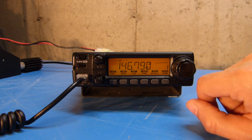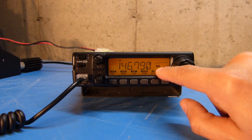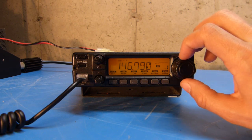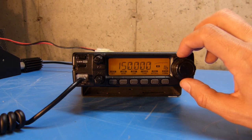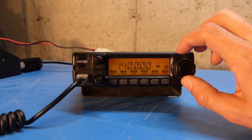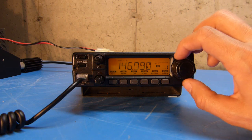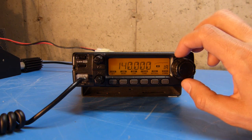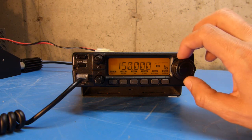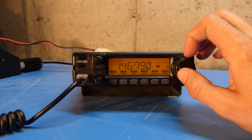To verify that, I can put the radio into memory mode by pushing the M/call button. Pushing it once puts it into memory mode — you can see the M is lit and not blinking, and the channel number is there. Because I've only got one memory channel programmed, it's only tuning between memory channel 1 and channels 1B and 1A. Memory channels 1A and 1B are actually scan edge settings used for scanning the VFO between certain frequency limits — in this case, between 140 MHz and 150 MHz. I've now got memory channel 1 programmed and can continue programming all the other memories I want.